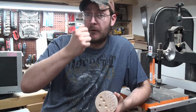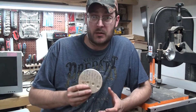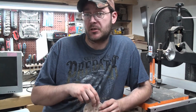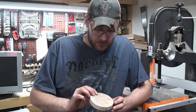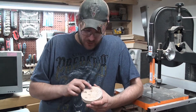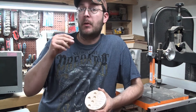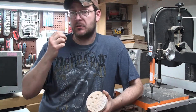The feed rate — like how fast you're plunging that router bit into your wood — plays a big role as far as the quality of how your dimples turn out. I was also playing around with the RPM speed on the drill press. Here's a close-up. As you can see, with balsa wood, RPMs didn't play that much of a factor, but feed rate played a big part. Plunge it in too fast and you get tear out.